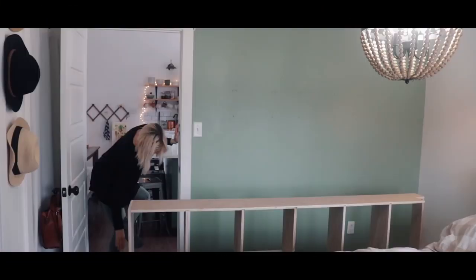So we sanded it and installed it. I built a little frame out of one-by-sixes — because we have about five-and-a-half-inch baseboards, I had to get up above them so it would sit flush against the wall. A one-by-six was perfect since our baseboards are just under five and a half inches. I made a little frame out of one-by-sixes, screwed them to the baseboards, made sure everything was level, and then set the cabinets on top.